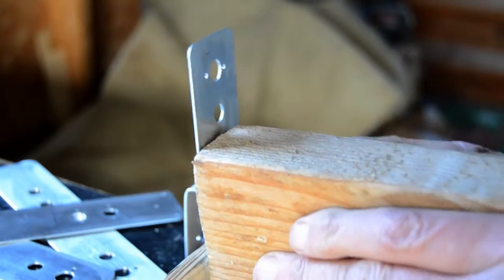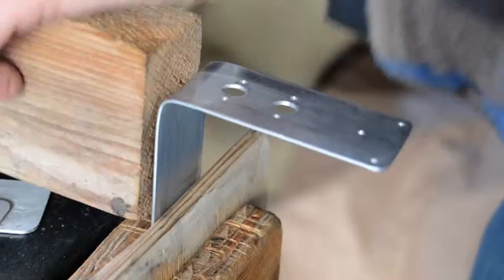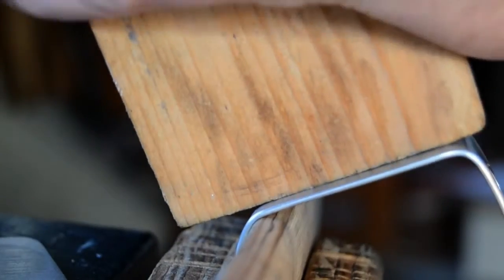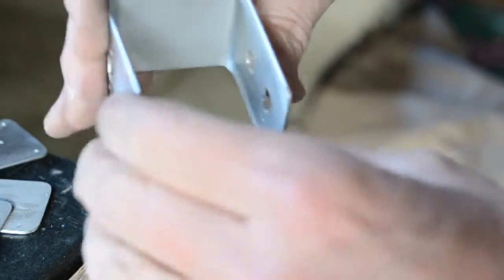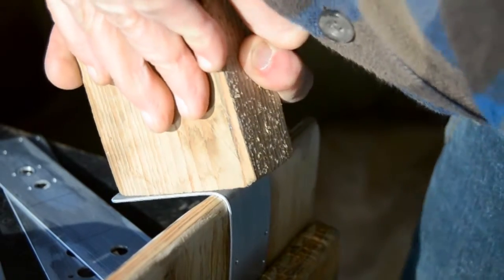This is easy, except that it has to be done pretty precisely, so holes match up and the final shape is correct. Also, you don't want to bend too far because it starts to get brittle when you bend it back. I used a pretty big bend radius so the metal would maintain its resilience.